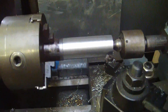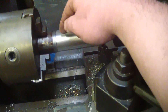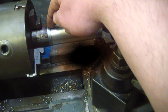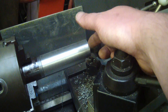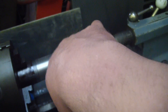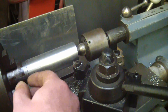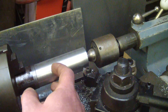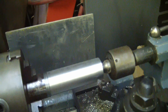So I don't have a taper attachment and I don't have trig tables memorized. How are we going to cut this taper and figure out what taper to cut? Well, the easy way is to go step by step and figure it out. We want this end to be half an inch, and this is going to be an inch and a half, so that means we got to take away half an inch on the radius over four inches. That's 0.5 divided by 4 equals 0.125 every inch. Now I want the steps to be closer than that — we're going to go quarter inches. So a quarter of 0.125 is about 30 thou. That's how I got there.